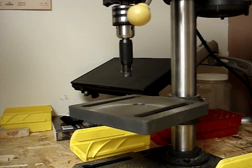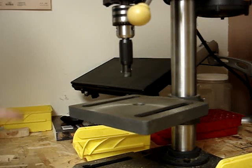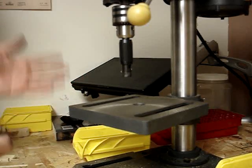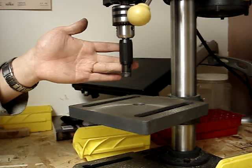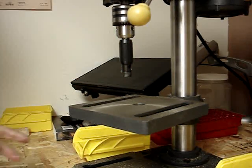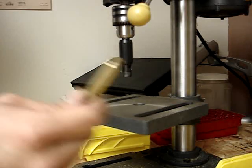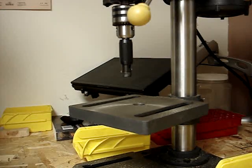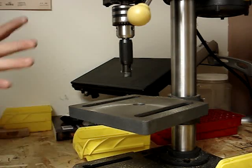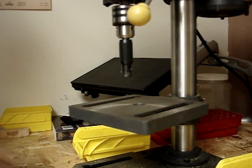Today I'm going to show you guys how to use the Possum Hollow Quick Trim for the .223. I've got a setup here that involves just a $60 drill press, a $25 Quick Trim, and a $10 power adapter from Possum Hollow. Using this setup, I've found a way to trim .223 brass to within about 0.0005 inch tolerances, which is pretty good for this.